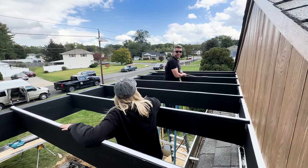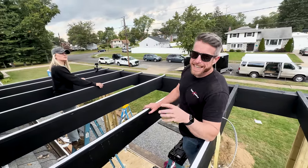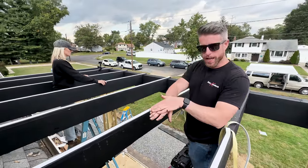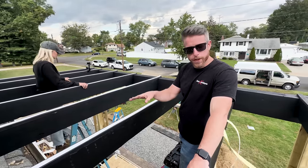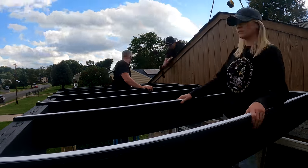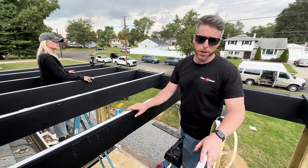We're starting on the easy glaze roof system here. It's a polycarbonate panel, overlapping, standing seam kind of pergola rooftop. And it's gonna be really nice for our porch roof here. So we'll show you how it goes down. First step is putting this little foam tape on here. It's just gonna reduce some friction between the plastic and the wood. And they should go up pretty quick.